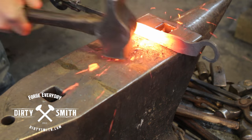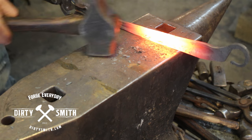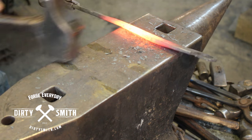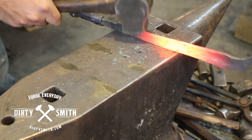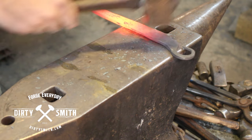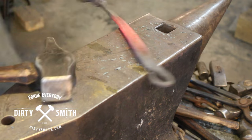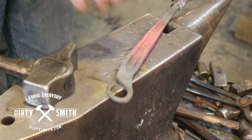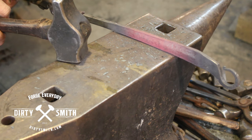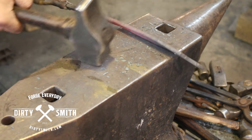I'm hitting it this way, causing that to bend. If I can get the bottom to bend, great — if not, put it on edge a little bit and kind of get that cupping going on. Then we're going to put the handle apart. By doing this, we're taking advantage of some hollow space to give this volume without metal being there. Try to take advantage of the space around the steel instead of always simply adding more metal.